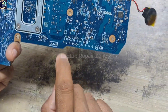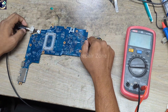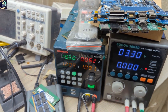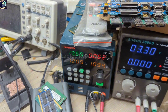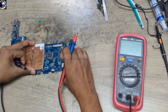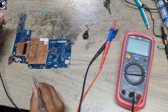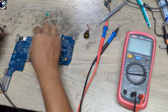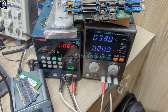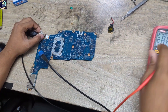This is my motherboard part number, and now I will check the condition of this motherboard. Let's plug it in. Look at my power supply — as soon as I plug it in, it's taking 0.062 amps, but it's not turning on. I'm going to disconnect the RTC battery. If there is no other problem, after removing this CMOS battery it will turn on. Let's try again — it's plugged in, still the same, it's not turning on.